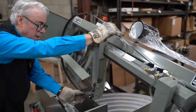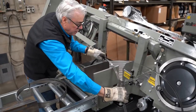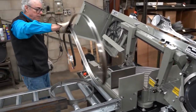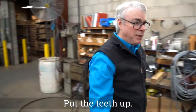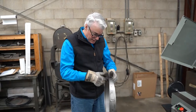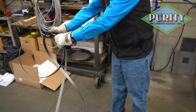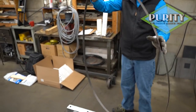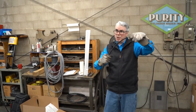At the halfway point, we're going to bring the two together and hold it right in the middle like that. That's the safest place to hold it. If you put it on the floor, you put the teeth up. Now when this blade comes out of the box, it's a 50-50 chance the teeth are pointing in the correct direction. You want to open this carefully and with gloves. You don't run the saw with gloves on, but you work with the blade with gloves on.